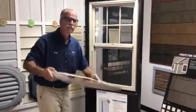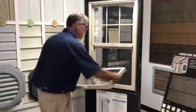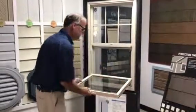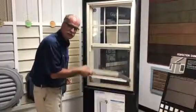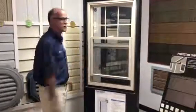That's all there is to it. So when you get your new sash, just grab hold of it. Set it right back down in there. Do that a couple times to make sure it's seated down into the balances. That's all there is to it.